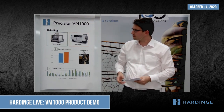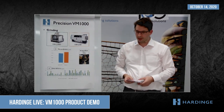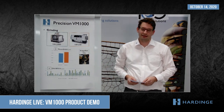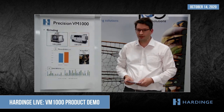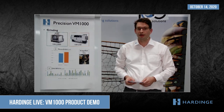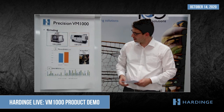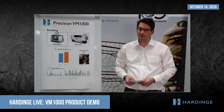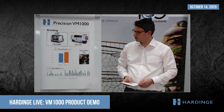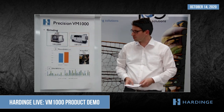To the second measurement, we have done grinding on the VOUMARD 1000 and the VOUMARD 150 machine to compare them. We have ground ID diameters on a ring workpiece 30 times. The first focus goes to a comparison of the standard wheel heads, workheads of the machine. As you can see on the blue bar, we have reached a very good result with the VOUMARD 1000 of 0.2 microns. The VOUMARD 150 standard wheel head is also very good. To be mentioned, we have here the potential to use high precision work heads to go down and to get much better result than that.